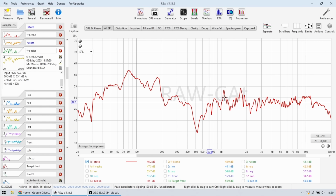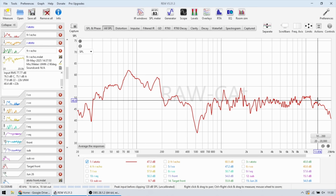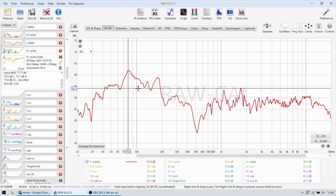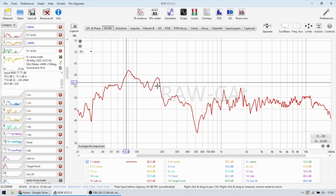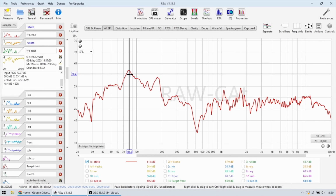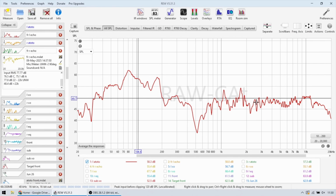The tweeter range from about like 800 is very, very nice. The only problem that we have is quite early roll off. We can see like 13, 14K it starts to roll off and there's not very, very top end like 16K where our hearing ends and where we hear all the airy stuff. We do have quite a big bump at about 100 to 150 hertz, which sounds like very full, but sometimes it could be a bit too much and it might be a bit too thick, especially on the vocals. But in general, this response is kind of okay.